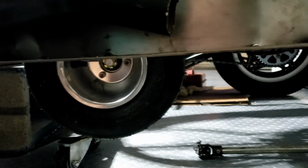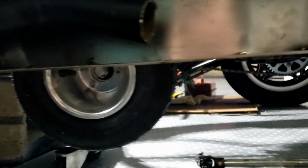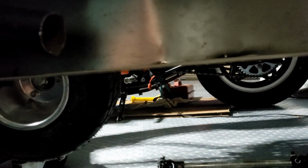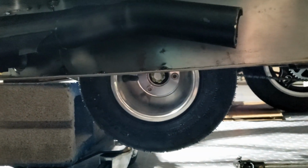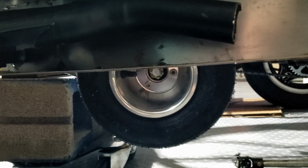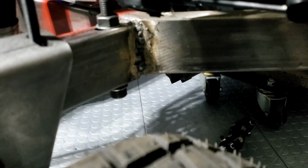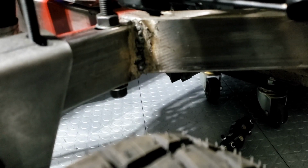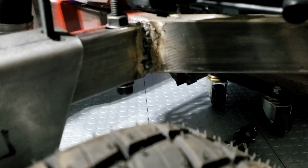Which, if you look at our new ride height, is cool. All right, because that's where the wheels are going to be, roughly. And the bottom of the engine is actually still sitting at the bottom of the C-frame. So we've probably got that much. What is that, 5 inches? Still think we might need some kind of skid pan up front, just to protect the steering if nothing else, and the bottom of the motor, of course.